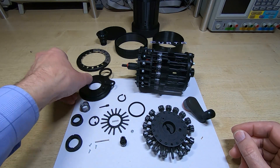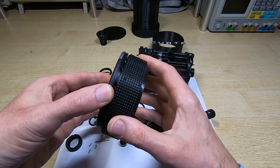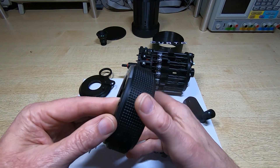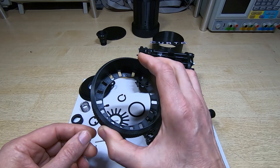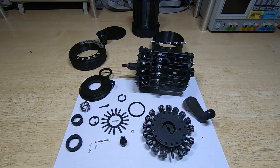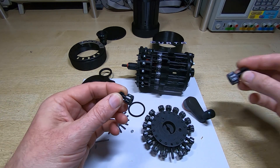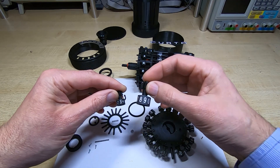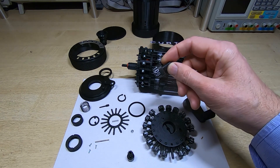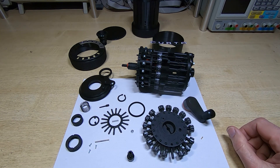You can get a very nice surface finish polishing PLA. Other challenges on the smaller scale include getting two parts to screw together — what is now quite a fine thread is tricky, but it's perfectly possible and screws together very nicely. Looking at the difference in scale, the results digit wheels and input wheels on the smaller version are very much smaller. In some ways they're easier to deal with because there's less material to take off, but obviously handling small parts can be a bit tricky.